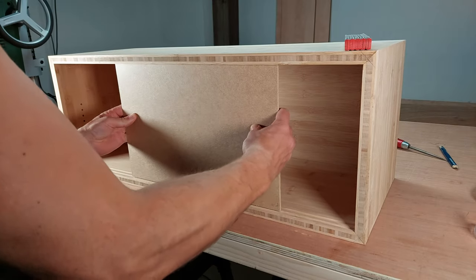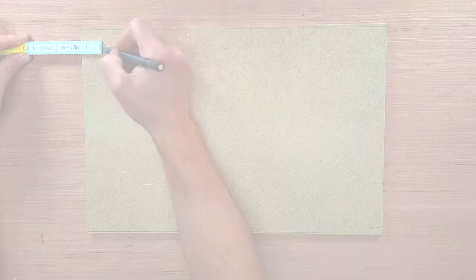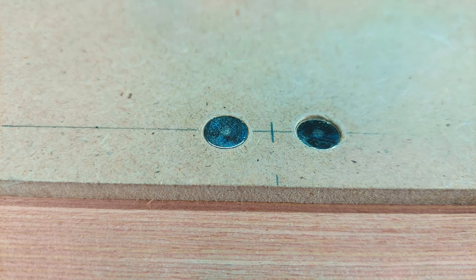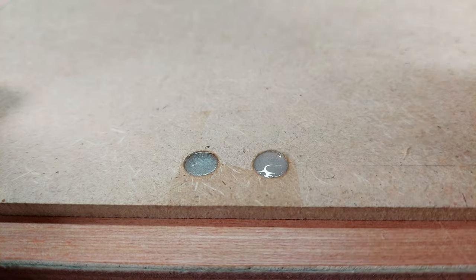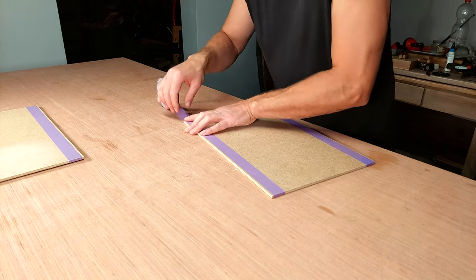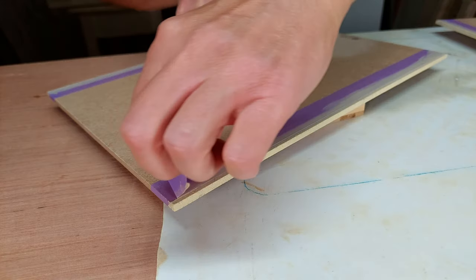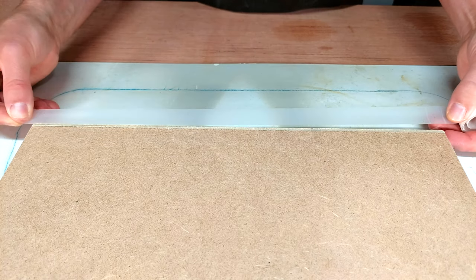Back to the sliding doors — I marked off the top and bottom areas where I don't want any fabric, then defined the exact midpoint and added the position for the handle. I drilled out cavities and pushed in the magnets with polarity switched, and a bit of fast-curing epoxy will fixate them until the end of time. The blank areas receive a layer of Rubio Monocoat oil to prevent wood from tearing out when I remove the strong transparent tape used as a non-stick layer for the wood glue.